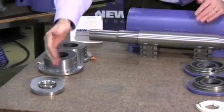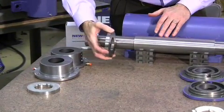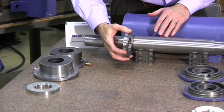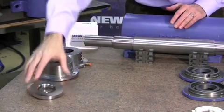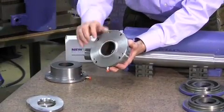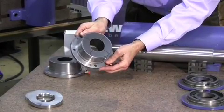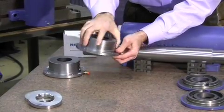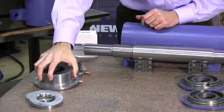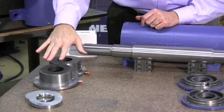You can see the air bearing units and the thrust washer, which slides over the same journal that the bearing had mounted to and runs up against the shoulder. The actual air bearing units themselves have both a journal component and a thrust component. This is New Way's porous media graphite carbon bearing, which also provides sealing because there's air pressure coming out of the gap all the time.